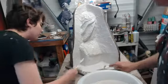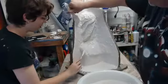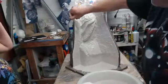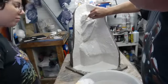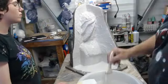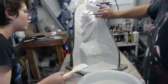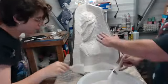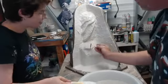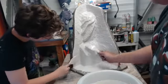This was a wash brush. Puddled a little? It did. I think I spread it out evenly. It's cloudy outside, so you know it's humid. Humidity will definitely affect how this stuff sets, though it usually prolongs it, not hastens it. But you see how, by continuing to move material around and keeping it a little bit wetter, we maximize the life, because it's definitely getting creamier. But we don't want to overfill those gills quite yet. We have enough material on there to fill the major parts of the undercuts. Now we just want to keep it even and wet.